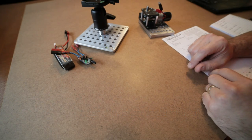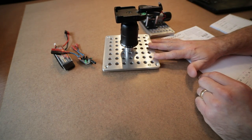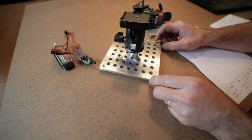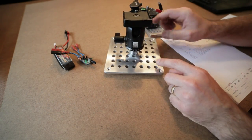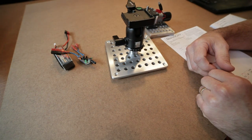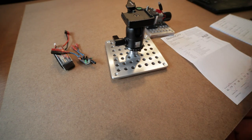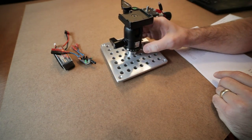Okay, moving on to the next component, we have the upper plate, which will be mounted onto the 3/8" output shaft of the gearbox. I forgot the dimensions, it looks like about 6x6 roughly. This is a 1/4 inch 6061 aluminum. Drilled out a lot of holes to save weight. I could have gone overboard here with the aluminum and the strength. There are various materials you can use, so stick with your imagination. This was kind of ad hoc engineering. I have a good metal supply shop. This plate was only about $4. The 1/2 inch was $7.